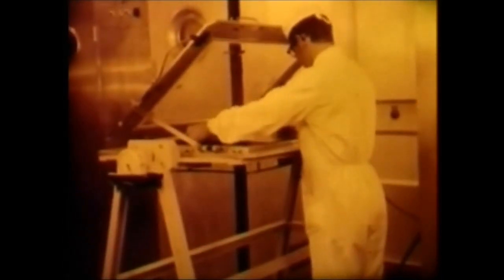Once dry, the photosensitive sheet is clamped in a frame between two negatives. Each negative carries a pattern of nearly 500,000 black dots. The sheet is now exposed to light through both negatives. During the exposure, the emulsion hardens and becomes insoluble. The unexposed dots are washed away to provide holes in the hardened emulsion for the etching process.